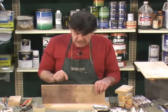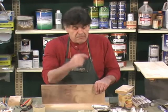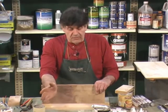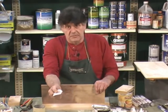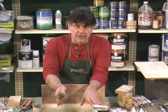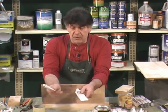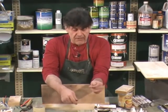So in this case, the epoxies work extremely well. So do the polyesters. Now, the polyester you're going to see out here, and some of them call it super wood filler and whatever, and you're going to know it's body filler because it's going to have a catalyst with it, a hardener. Now, typically what we buy is just the body filler from the auto body supply store. And you're going to see it in two different colors. It's going to either have a pink filler or a blue. We prefer the pink. It's the easiest to color, if that's what we're doing.